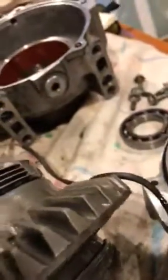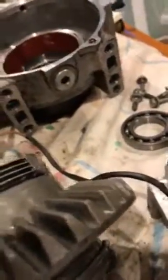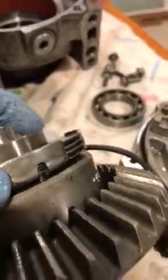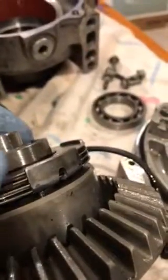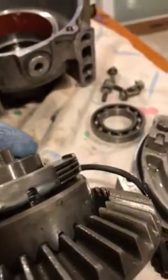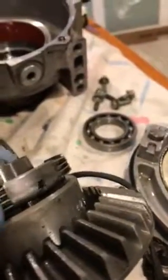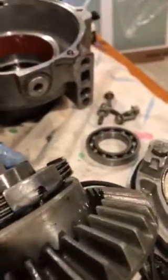What's important is that you actually get these guys right here — those pins have to line up with those little guys right there. And when you assemble, that should sit like that. Make sure you're not countering that little hole like that; you'll never press it together or push it back together, and it will spin. Those little pins are what actually holds your forward drive.